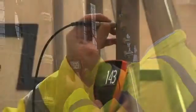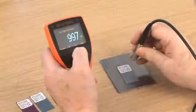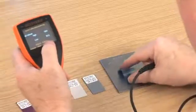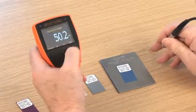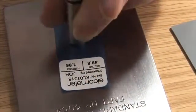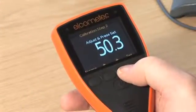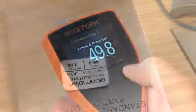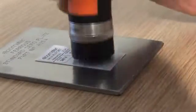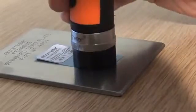For more information, a full instruction manual is available at www.elcometer.com. There are a number of ways to increase the accuracy of your calibration. When calibrating or taking measurements with your gauge, here are some simple do's and don'ts. 1: Take more readings on each foil value or bare substrate. The gauge then averages out the readings, increasing the adjustment accuracy. Using the up-down soft keys, you can synchronize the average reading so it is identical to the certified value on the foil. 2: When taking readings, avoid the foil label and place the probe in the center of the foil.